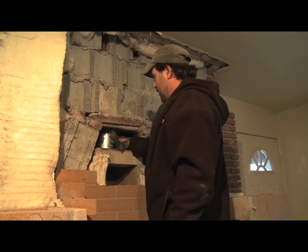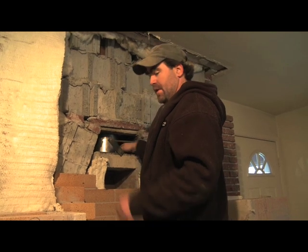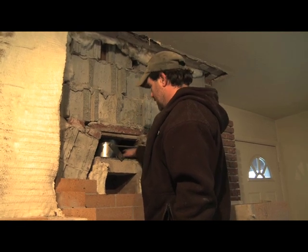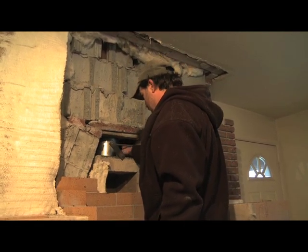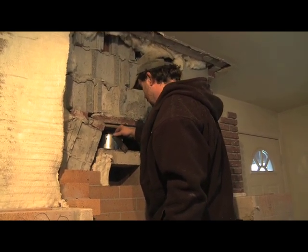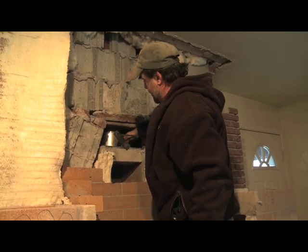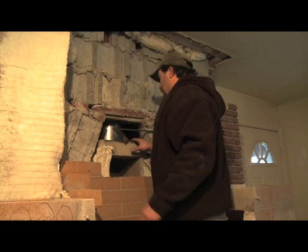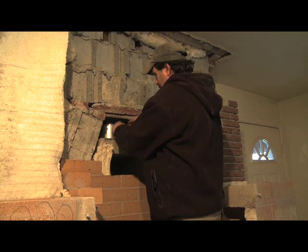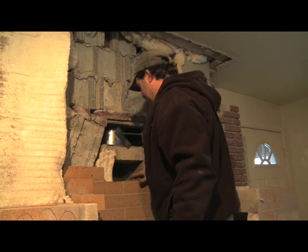We're relining this chimney with a stainless steel liner, and we'll pour vermiculite concrete around it, and that'll be insulative, and it'll also lock it in place. So we just dropped the chimney through the existing chimney opening, and we've seated it on the plate, and we have to seal around here with some caulk, and we'll block this area out for the linkage so that it stays free of any kind of concrete, but the rest of it will be encased in this vermiculite concrete.